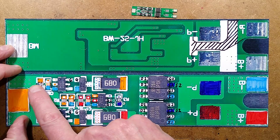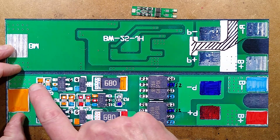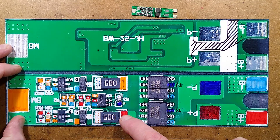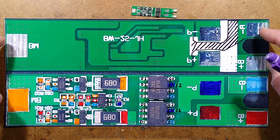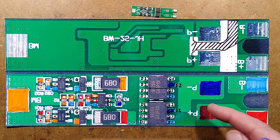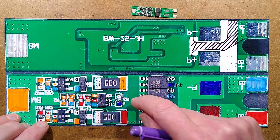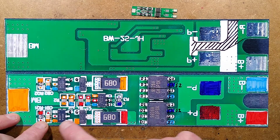The other sections on this circuit board - there are actually two completely independent sections. Each cell has its own balancing circuit. We've got the spot-welded tab connections for the battery, the power takeoff wires from the battery pack, these big fat resistors and a MOSFET to switch them, the sensing circuit to detect when overcharging is about to occur, and then the control circuitry.